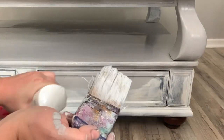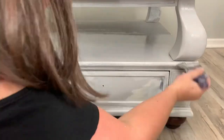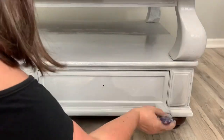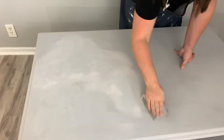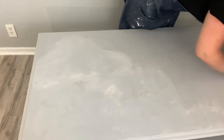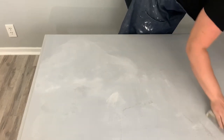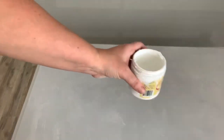So I decide that I'm going to use the Aged Gray for the base of the table too — just put it on the entire table and then figure out exactly what I'm going to do after it's covered. When the table is dry, I flip it upside down and do two coats on the feet. Now here we are again with a ton of brush strokes and I'm just not loving the way it looks. I use Rust-Oleum's paint all the time and I absolutely love it, but I decided we have to cover it. I sanded it again and decided I was going to do a whitewash.